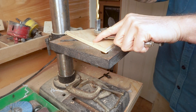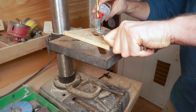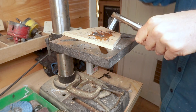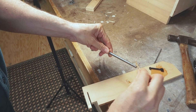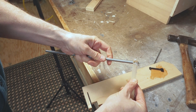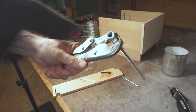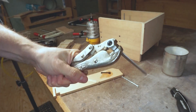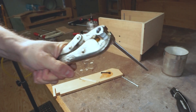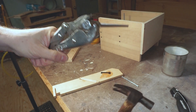This is a 5/16ths coupling nut that I'm drilling out so that I can epoxy it onto the lead screw and use it as a bolt head to turn it — just kidding. I'm going to put the coupling nut onto the end of the lead screw and just loosely put it on there, then hit it with a hammer. The inertia of the lead screw holds it in place while the coupling nut slides down with a lot of force and jams on there really tight, and that's just never going to come loose.